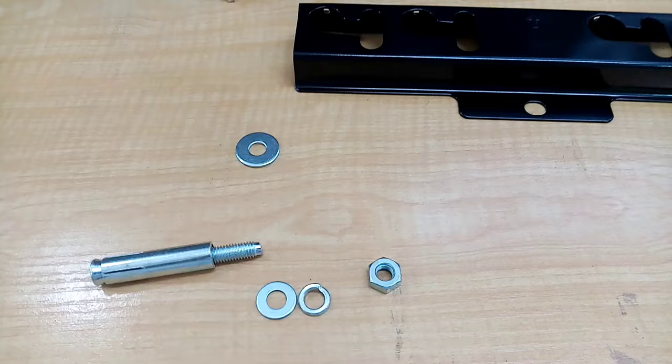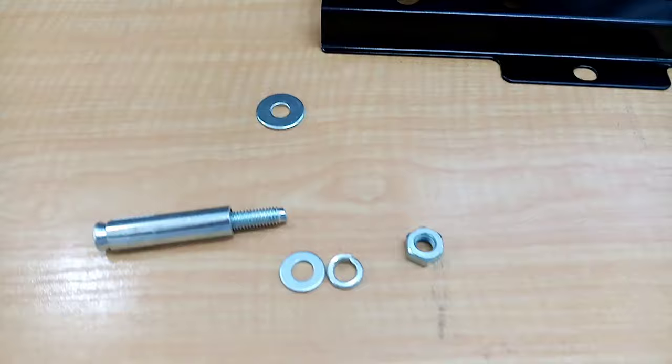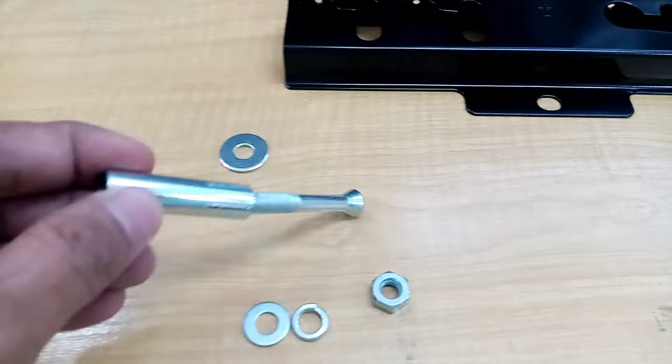First thing to do is to drill a hole big enough to insert the head of the expanded bolt. Then remove the washers and nuts. Only the bolt itself and the expanding tube must be inserted inside the hole.